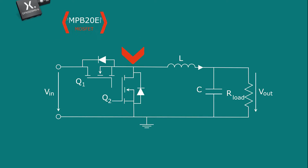For synchronous conversion, the diode is replaced by a second MOSFET. This is done because the forward voltage drop of a MOSFET with sufficiently low RDS(on) is much smaller compared to Schottky rectifiers of the same power class, meaning that the conduction losses of the low-side switch would be reduced by a great amount. Whenever switching takes place, charge needs to be transferred within the MOSFET. In a synchronous converter, there is a short time when both switches are open — this is the so-called dead time. During this time, the body diode of the low-side MOSFET is conducting, which is highly unwanted since it has a high forward voltage.